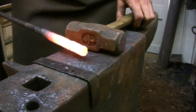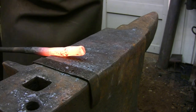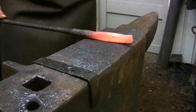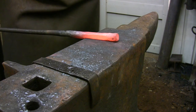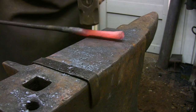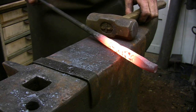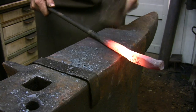The offset that I'm using for this pair of tongs is three inches long. I define the offset at the corner of the anvil right next to the ruler so I can keep an eye on whether the piece is drifting out of position, and then I'll move over to a corner of the anvil that has a bigger radius. I'm hammering down the flat section that's going to be used for the curved part of the bit, staying away from the very end of the bar because I'll need that extra material to form the bit. To forge the next offset I rotate the bar counterclockwise 90 degrees and forge the second offset that's going to define the hinge area for the tongs.